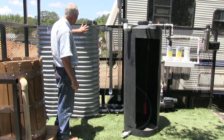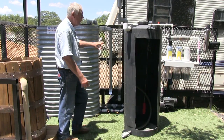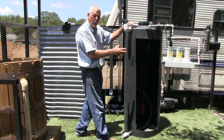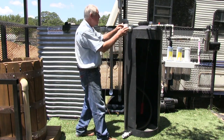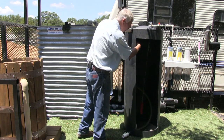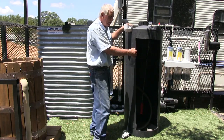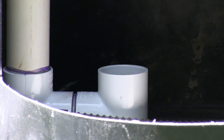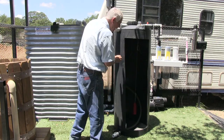I want to show what's inside this collection tank, so I have a smaller one cut open so we can see the inside. First, water coming off the roof goes into the storage tank through what's called a calmed inlet, where the water goes down to the bottom and then through a U-turn that forces it back up — so if there's sediment at the bottom, it won't stir it up.